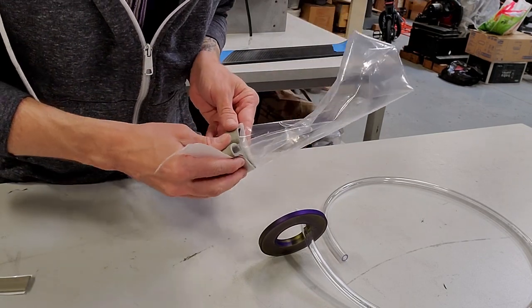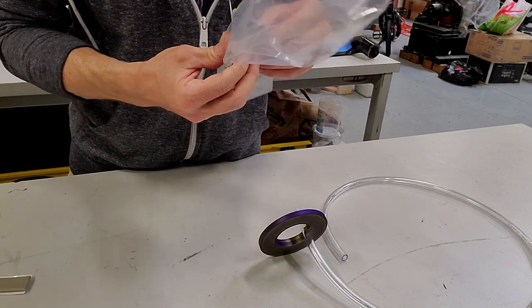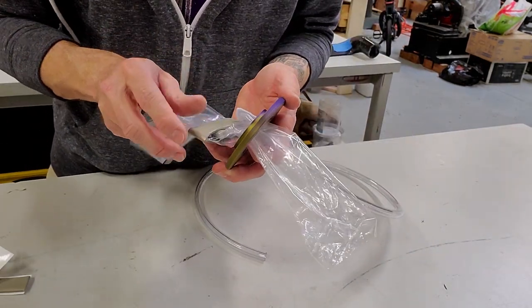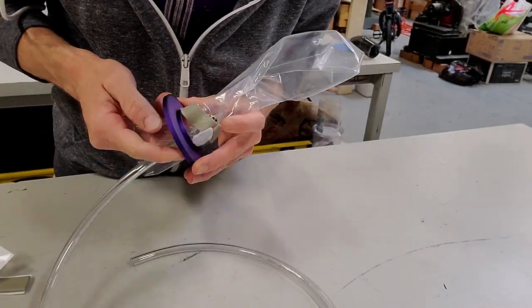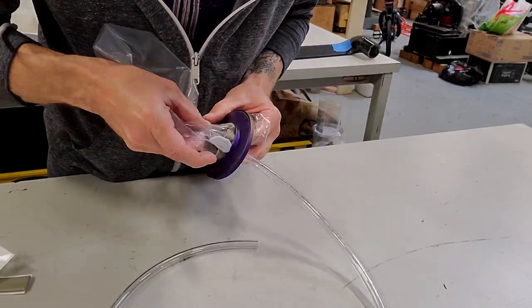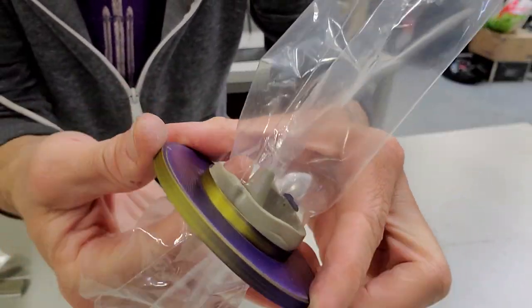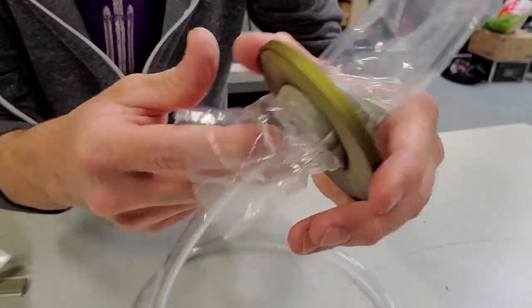And I'm also here, you can see what I'm doing is folding a neat sort of V-shaped pleat. This is to reduce the circumference of the bladder so that it'll fit inside the end cap flange here much neater. So we have a much neater application. I won't have random wrinkles in the bladder where the sealing surface is. So now I'm just working everything into place, and you can see here already how much neater this is, and it's much easier to just ensure that everything is really pressed down and sealed with the gum tape.